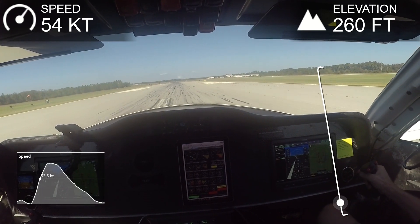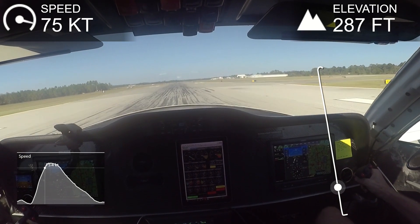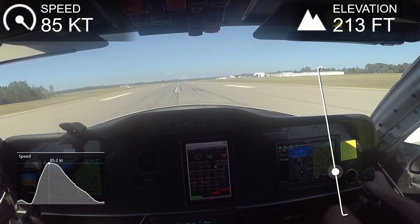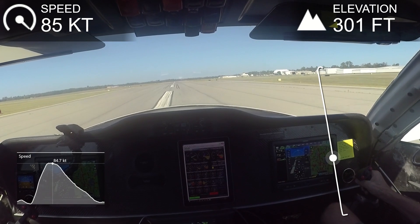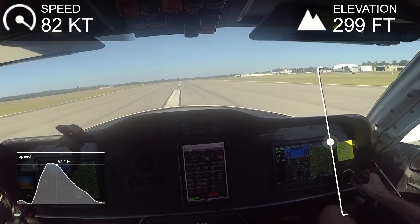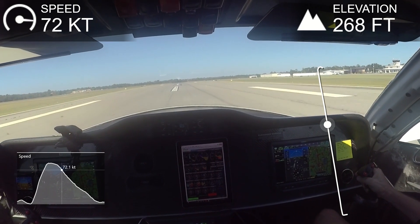It's performing pretty good. I had the prop set to flat pitch and just got full power, compared to what I did on that first flight. I took it up to just over 80 knots and then pulled the power back to about 30% and kept it there for a little bit — also to be able to look in the logs and see how the cooling was when cruising at lower power, to see if temperatures were already coming down on the coolant via the radiator and also via the intercooler. It's looking pretty good; I'm not too worried about the power now.